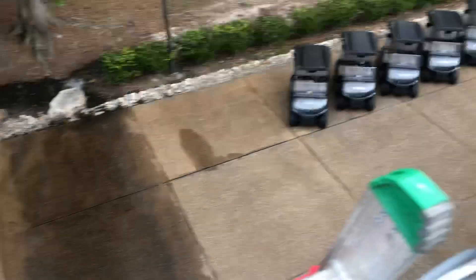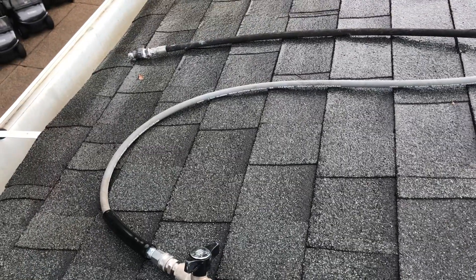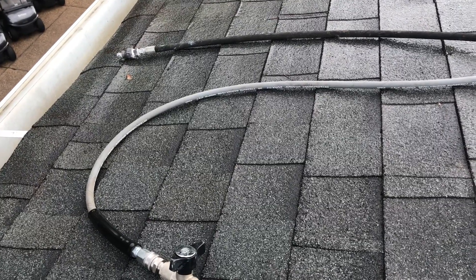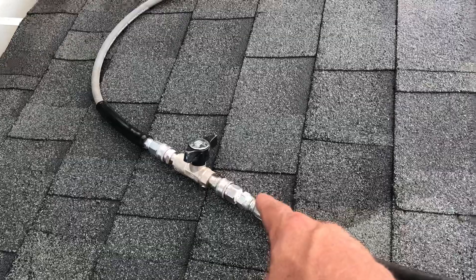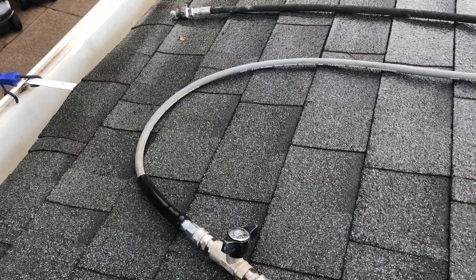That's what did the trick. I made this video to show you guys what to do in case you come across a similar situation — a downspout that doesn't have 45-degree elbows and has 90s, making it hard to snake out. You can make a six-foot jumper hose, put a zero-degree blaster tip on the end, connect it to your ball valve, snake it through the downspout, and turn the ball valve on once it's inserted all the way up to the clog. It should work — it worked for me. I hope that helps. Have a great evening, enjoy your dinner. God bless you, bye.